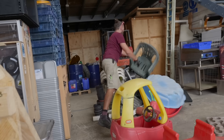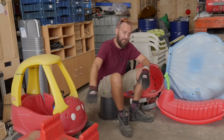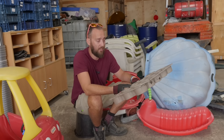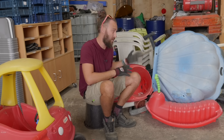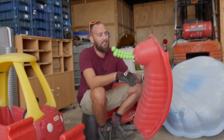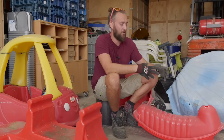This is all polypropylene — probably 90% of the stuff we collected is polypropylene. We've got a little bit of HDPE, and then we've got one thing which is very, very brittle polystyrene. A lot of these vacuum-formed plant trays are always polystyrene. We can recycle all of this material, but we want to keep it separate. Interestingly, this thing is polypropylene, but the little green antennae are HDPE. So these need to be in a separate pile so that when we recycle it again, we're not mixing materials.